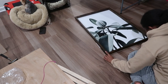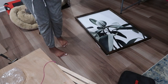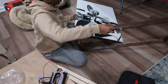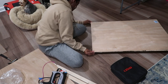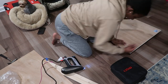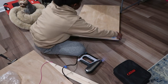I placed my frame on top just to make sure it was sized properly — as you can see there are some parts hanging off, but I tried to correct that at the end. I took my finishing nailer — not a cordless one but it does the job of putting in finishing nails — and nailed around the entire perimeter to secure everything in place. I took my time and only nailed in certain places first, then adjusted as needed since I was able to shift things around to make sure it was in the exact position I wanted.